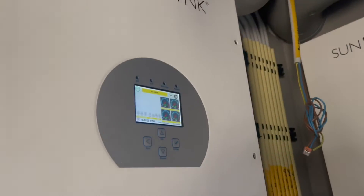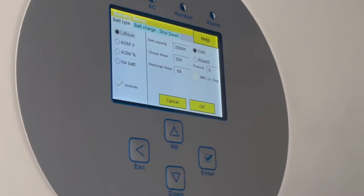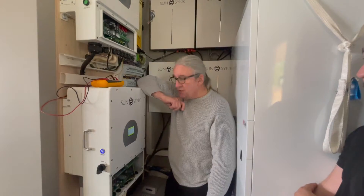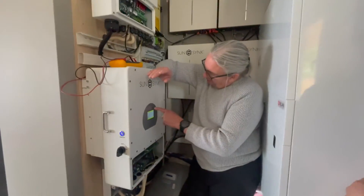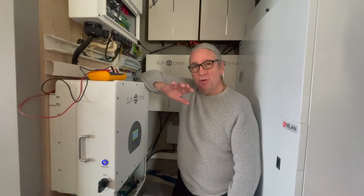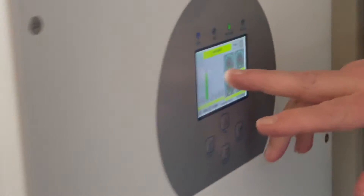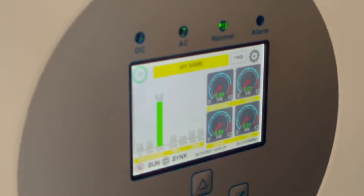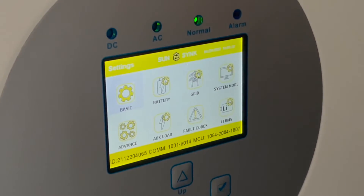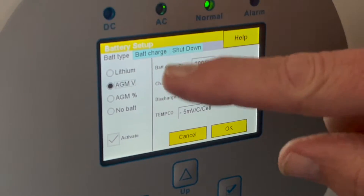We've got our battery charge settings here. We're going to change the settings a little bit because this is a bi-directional inverter, so we need to look at all the settings carefully. We've waited and we're still on battery — we haven't powered the AC up — and we've got the normal lights. This is the honeymoon period where you can check your settings. I've set the battery on voltage rather than SOC because SOC won't give a very accurate reading as this unit has no comms.